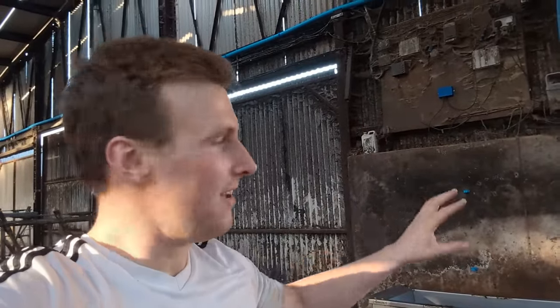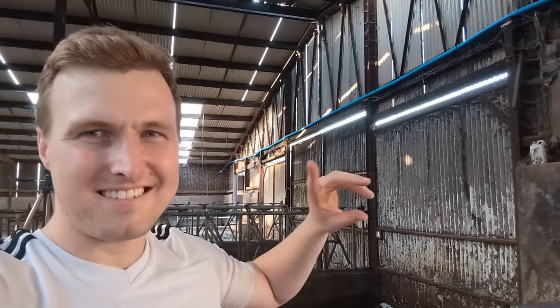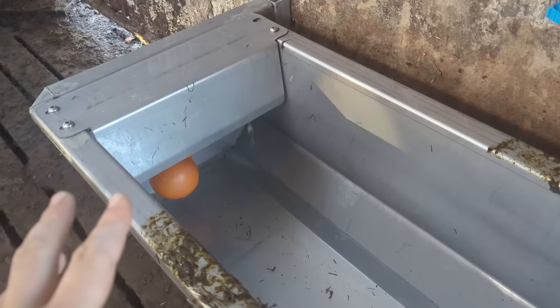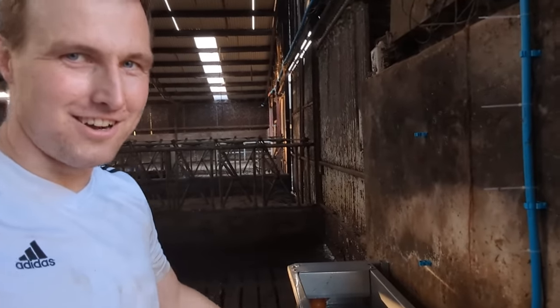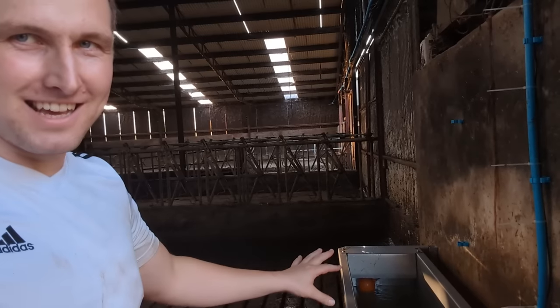Let's test the final relay, and we'll also measure the flow rate because we can just read the flow meter, and we'll see what sort of a flow we're getting to these drinkers from our tank above the parlor, because there's not a lot of fall and it's taken 60 meters of pipe to get here, longer, 70 meters of pipe. Okay, so we just turned our relay on up here. That's our control box. And our drinker is filling pathetically slow. Good news, I think it's just airlocked. It's spluttering and letting a lot of air out, and it is getting faster. Okay, let's get this video finished.